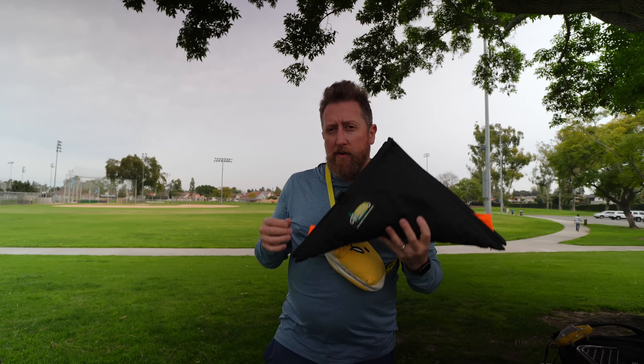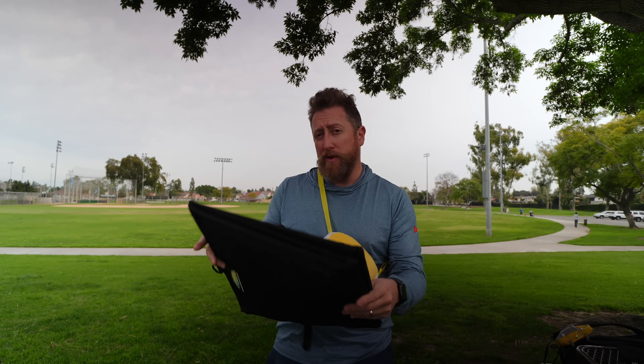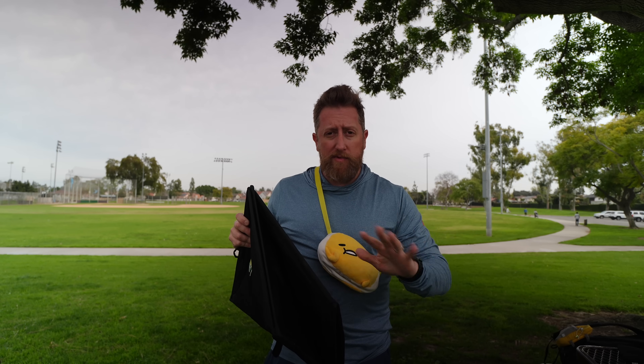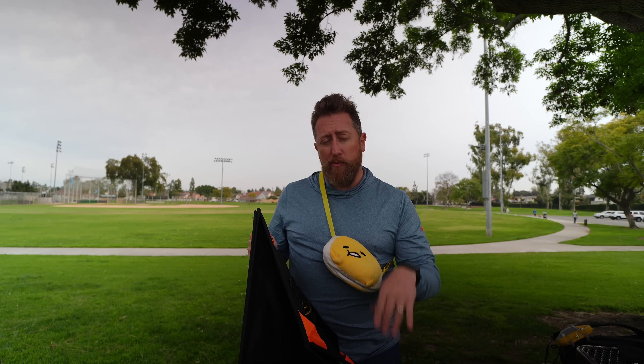This is my Weaver throw bag and line. I'm going to throw a line into the tree so we have no resonant materials nearby, just this cordage. We're going to hang the J-poles on it, get them to the exact same height, and we're going to test using my SDR at home, receiving signal strength and audio coming out of my radio.